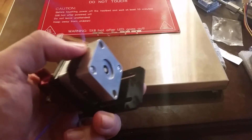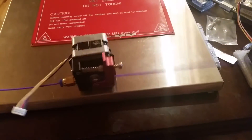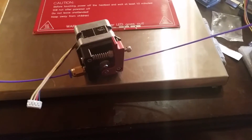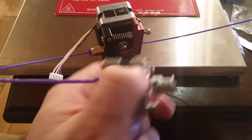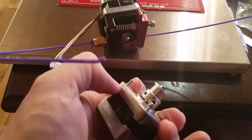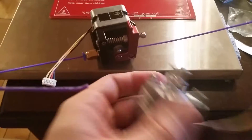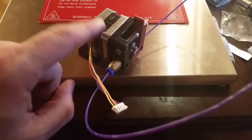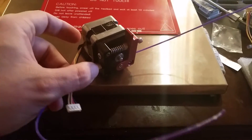My motors that I got off eBay — the motor is a bit small but it should work. I've had it up and running and it moves this test piece of PLA just fine. Of course it'll be different when it's pushing into a hot end. My motors are a funny configuration — they have these long M3 screws that come from the back all the way to the front, and there's only threads in the top half of the plate. So you'd have to cut them perfectly to bolt things down that way, but long enough screws allow you to simply bolt them into things. I had to get a little bit creative in how I attached this extruder onto the front of this stepper. I do have some other steppers of this size so I can get a beefier one if I need it, but I'll have to wait and see.